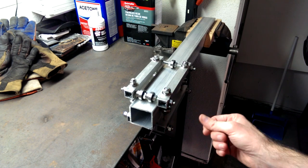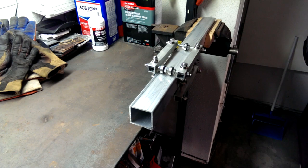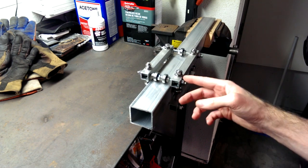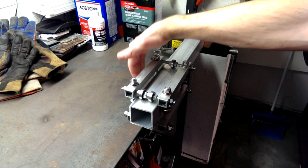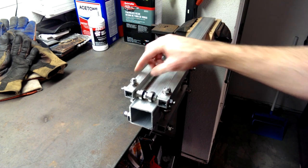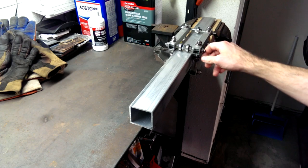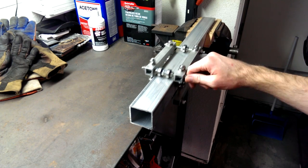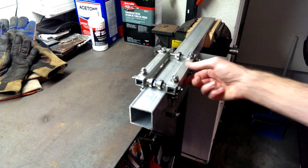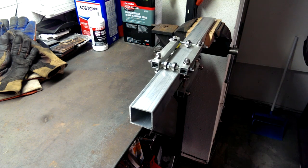The cool thing is how adjustable and how tight you can get this setup. These are all just finger tight, but you can snug it up in every direction. You can see how tight it is — it doesn't continue rolling on its own. Right through here, the tubes aren't actually contacting anything because the three-quarter-inch tubes are just slightly less than the diameter of the ball bearings, so nothing is dragging. This is all just the internal resistance of the ball bearings — ridiculously smooth with no play and no slop.